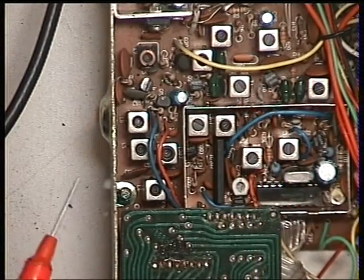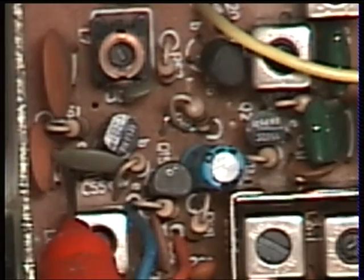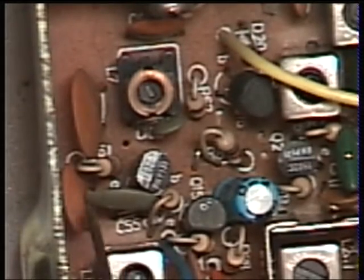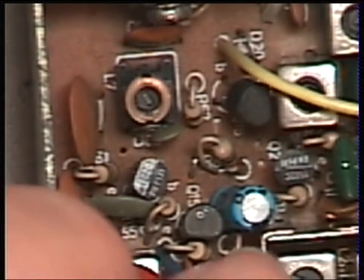What you have to do is locate Capacitor 55. Capacitor 55 is just there — can you see it? It's the green one. There's an orangey-brown one next to it. Capacitor 55 is there, and it's the left-hand terminal — that's where we're putting the diode probe.